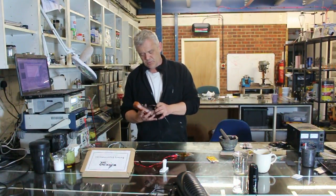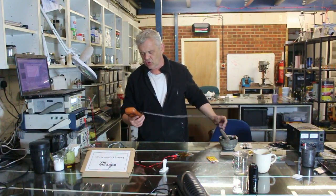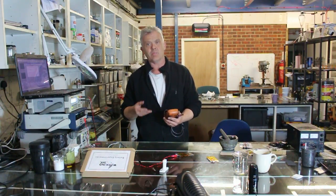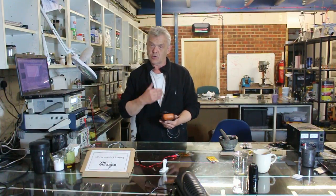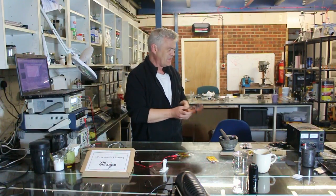You're going to need some kind of charging device, some kind of measurement device, and some kind of load. I've got here a Rigol DP832A, which is a programmable charger; a BK Precision 8500, which is a precision load; and the Rigol DM3058, which is a multimeter. These are all nice bits of precision kit and very expensive - I'm not proposing you go out and buy those. What the multimeter does is just record information so you can see how the device is actually performing. You don't need to spend that amount of money. This is a cheap simple digital multimeter from the local electronics store - I think it cost me about £10.